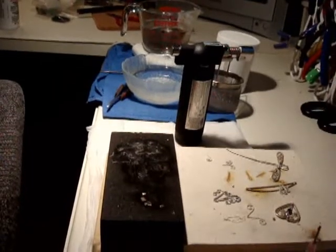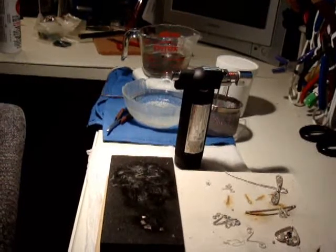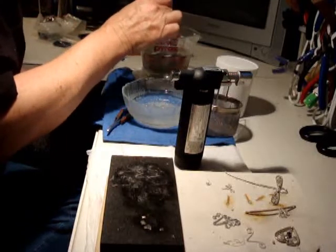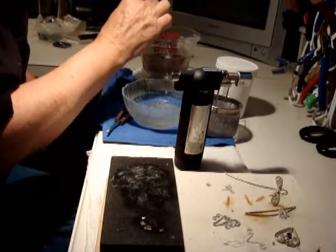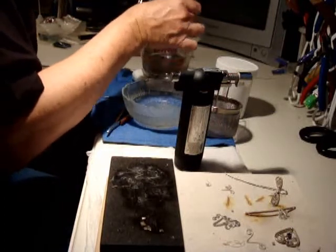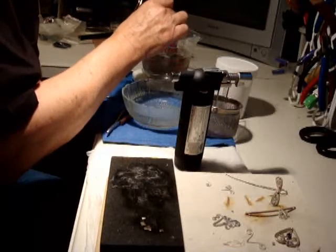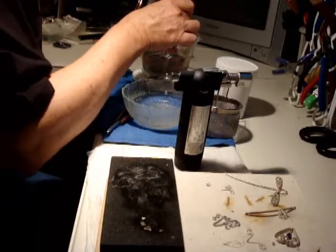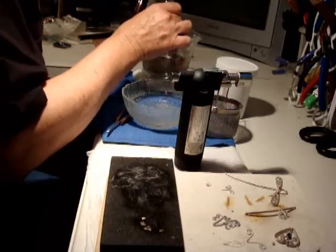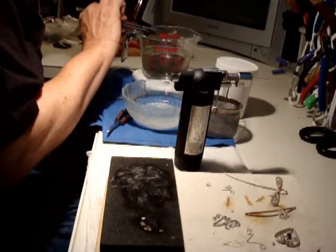And that pickle cup is staying warm on a little coffee mug warmer, and silver prep comes dry in that little white screw top container, and it's diluted in water, and you put 1 tablespoon of silver prep per cup of water, and I'm using 2 cups in case I'm using a long piece of design work. I make sure that I get it fully submerged.